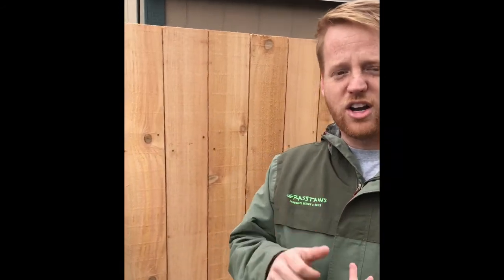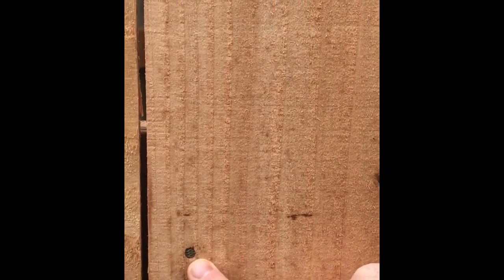To me it's a no-brainer to go ahead and use either stainless steel nails, screws, or a coated screw. On all our projects we like to use a stainless steel nail on a simple cedar fence like this one, but often we'll also use stainless steel screws. In my opinion that's the best choice — it's a small investment and it's not going to streak your fence.